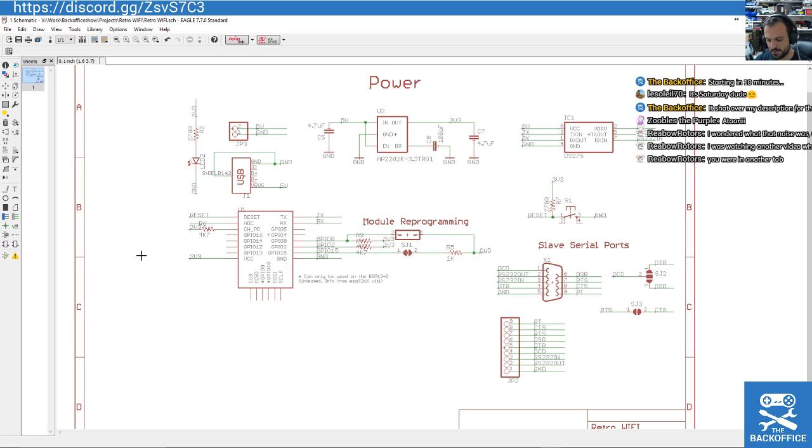And these are the ESP8266 chipset. So it's basically a system on chip for wireless transceiver with TCP/IP and embedded Lua and a whole bunch of GPIO you can use. So it's a pretty powerful tool as a development tool.